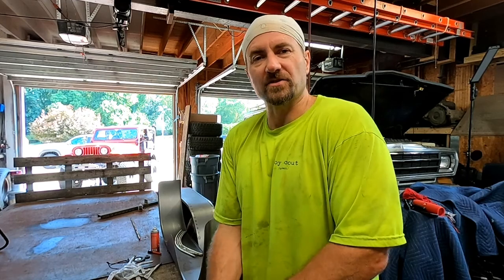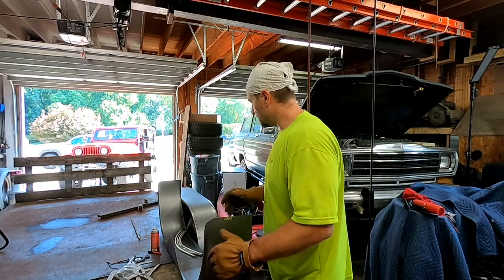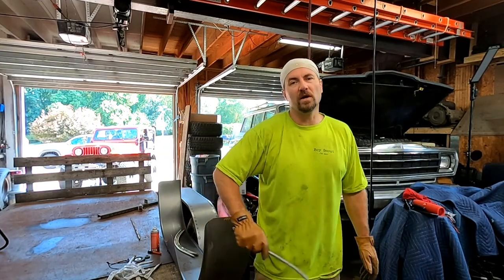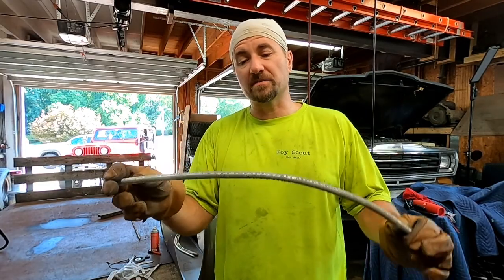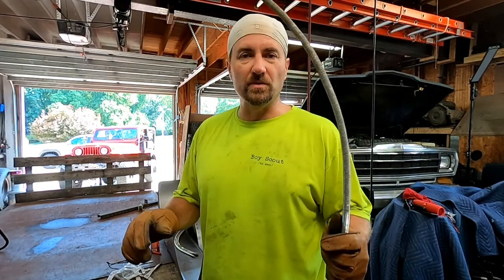I got my four bends — they're pretty close. We can start welding on one side and use some vice grips to pull it down to make it straight. One thing to understand: I believe this all-thread is galvanized, and the gas that comes off can hurt you. Please do this in a well-ventilated area. Also, make sure the fan is not directly blowing on your work because it just blows the shielding gas away and you'll get dirty welds.